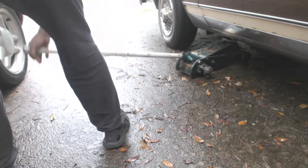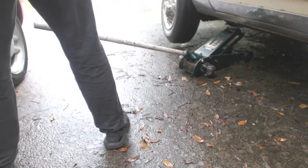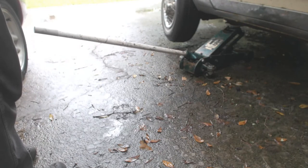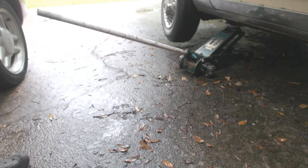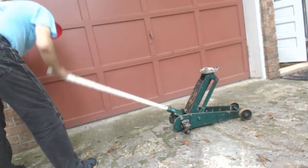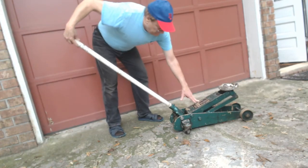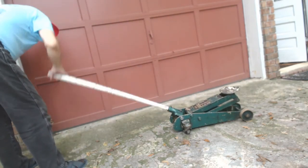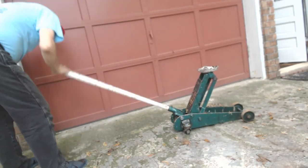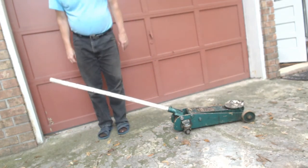Now it's time for the reassembled jack to get a basic test and see if I've made any progress. As you can see over the original problem, it's vastly improved, but it's still not what I hoped it would be. Here's the next step - the trick I had to play around with in the original condition. Basically, pump the jack all the way up to maximum extension, then continue to pump the handle just like you're trying to bleed air out of the jack, let the jack back down, then repeat the procedure again. Pump it all the way up, pump the handle for a while, let the jack back down.